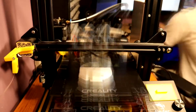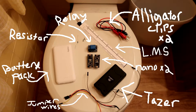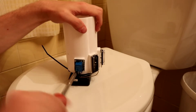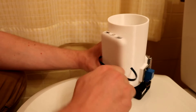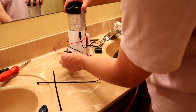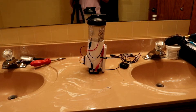So now that we have what we're going to make, the build should be super easy. All we have to do is first 3D model and then print some housing for all the electronic components. After that, we make sure the right code is on each Arduino — one being the receiver code and one being the transmitter code. We then get the rest of our electronic components, grab our case, and start slapping them together. I started with putting the hardware on first, then wiring everything up afterwards. I put the taser on the bottom of the cup since it seemed like the best fitting spot, making sure the wires didn't touch. They actually went off once and it really scared me. After the taser, we put on the battery pack which powers the Nanos. Before wiring up the sensor, I needed to flex-seal it so it wouldn't move and alcohol wouldn't leak out from the bottom. After that dries, we connect the alligator pins to the tin foil on the cup, finish up the loose wiring, and voila — you got yourself a very nice taser cup. Now time to do it all again for the second one.